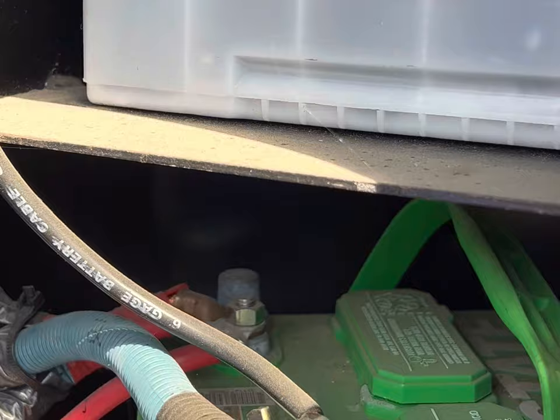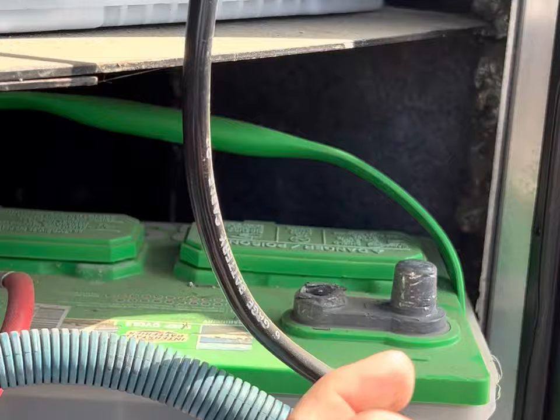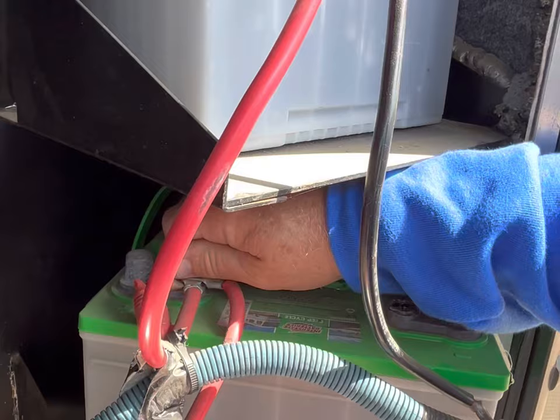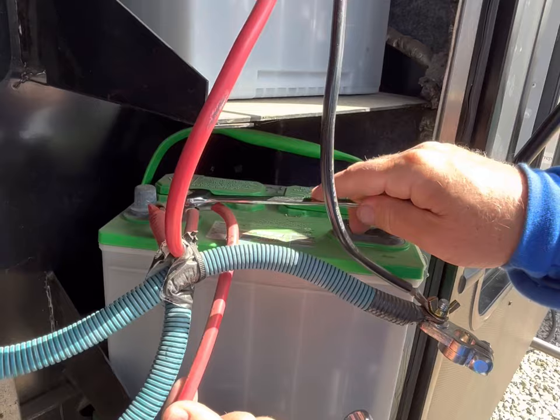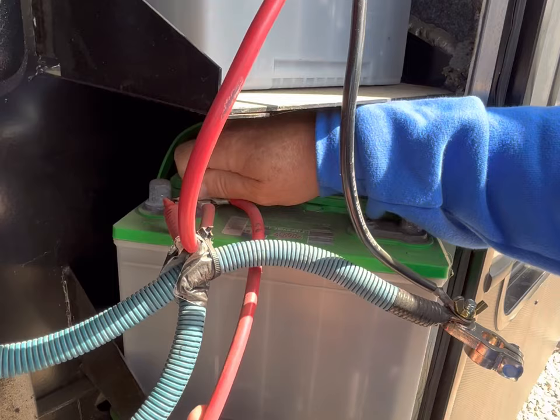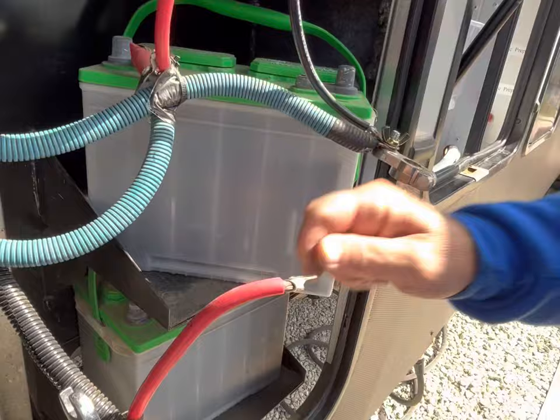And this one is actually a half inch wrench. We're going to have to go get a half inch wrench, and start with the negative side of the battery. Remove that. Again, be very careful when you're removing the positive that you do not touch the wrench on any metal components. That's very important. Components of the battery or the camper? Both. Okay. Here's the other cable that we can discard. We won't need that one anymore.